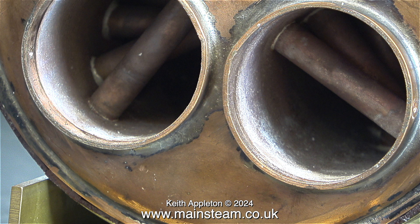Because the tubes radiate as you see here, it doesn't cause problems when I light the twin burners — they light beautifully. Some other twin flue designs with cross tubes have a lot of air in the flue, so when you light the burners they light with a bang. The burners on this boiler light in a much more subdued manner.